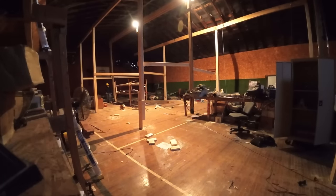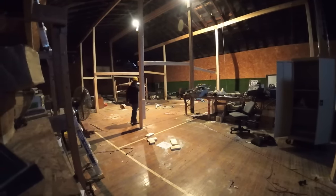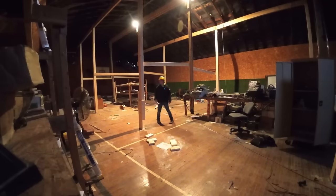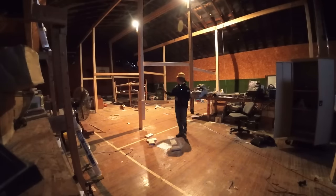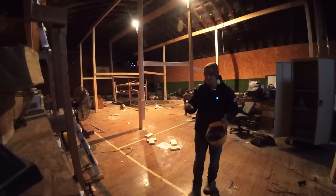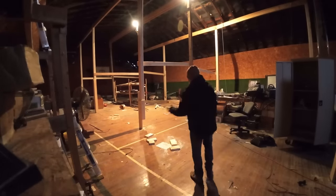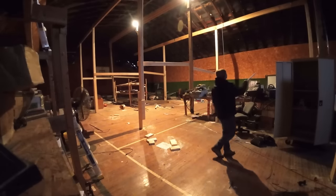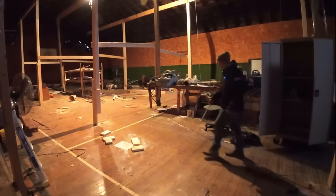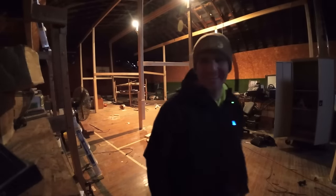We're about a third of the way up the stroke on the first one, moving to the next and keep working back and forth. We're going to leave that one sit for a minute, let it make up its mind. We ended up pretty close to a full stroke on most of them, but she's pretty chattery — we'll let her think about it overnight and come back in the morning to finish it off. Tomorrow's video we're going to start getting the cable system hooked up with the come-along to help pull the wall in. This end the trusses must still be fairly strong because it's lifting the whole thing. I'll run those boards down and hopefully the time lapse turned out — I'll catch you guys on the next one.